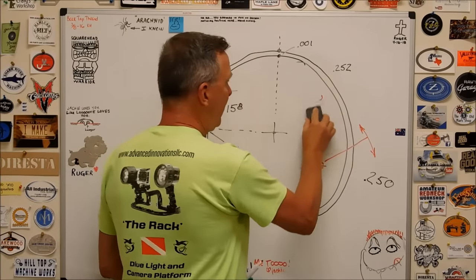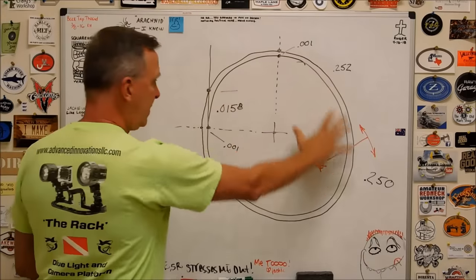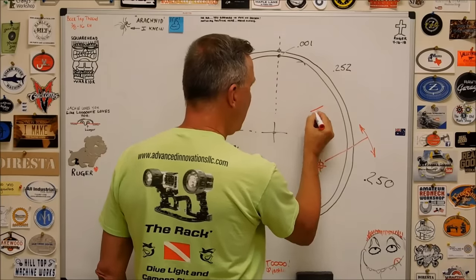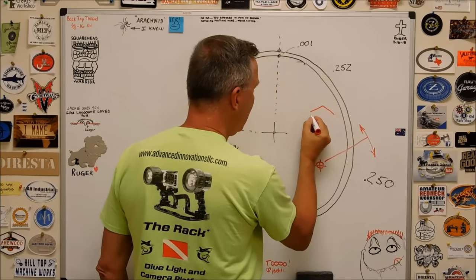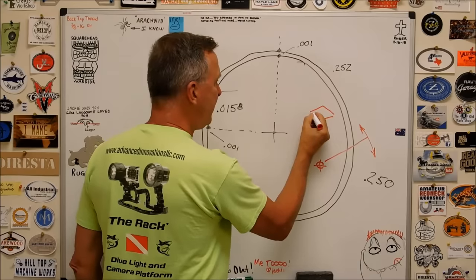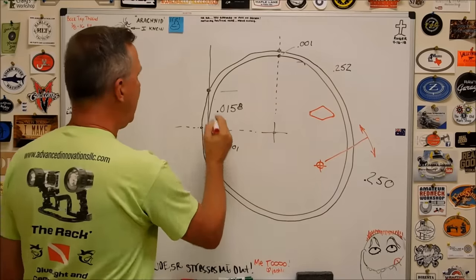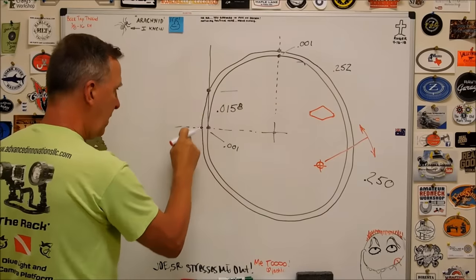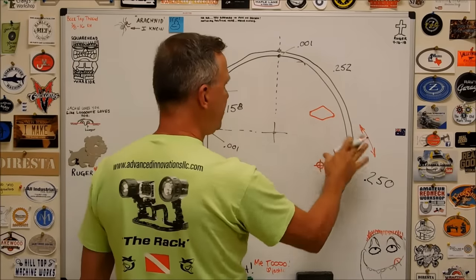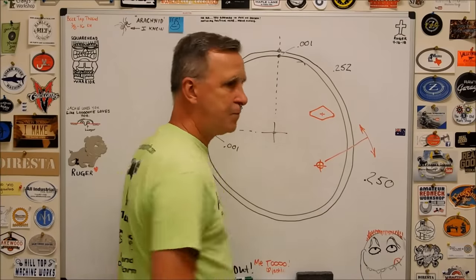Now I'm going to draw that a little bit out of scale, of course, but just to give you the idea, based on the black graphic, the diamond pin would be shaped like this. Just like a diamond. But on the outside edge, you still retain some degree of the radius of the original pin. And that is right here. That is that particular chord of the circle which controls the angle. Boom.